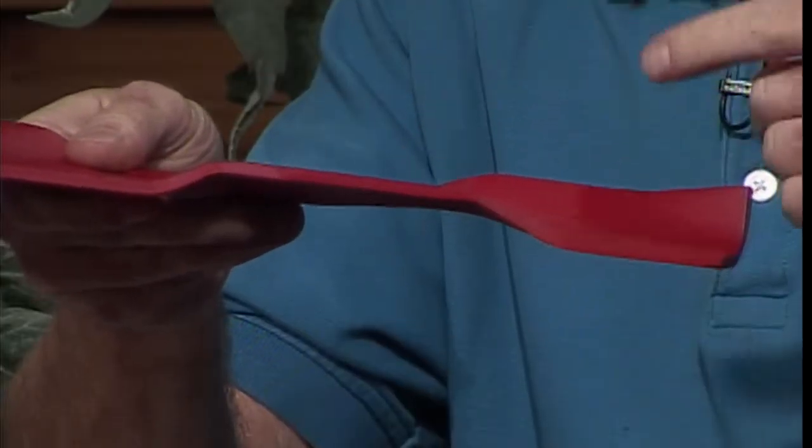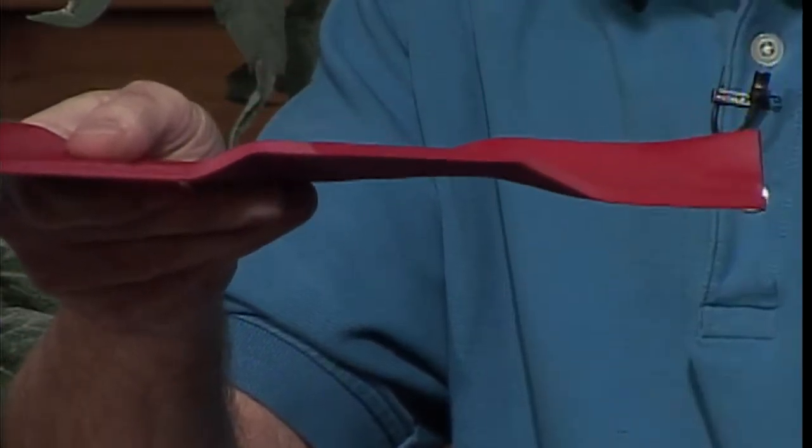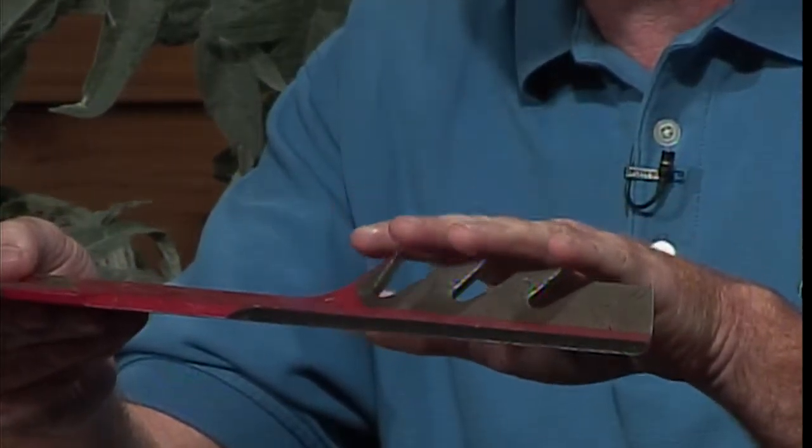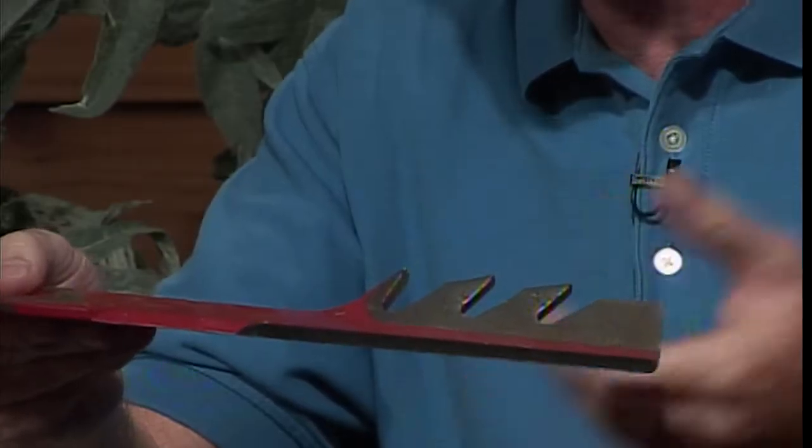So if you're wondering how we do that — on that mower you first saw, it had an enclosed deck with no side discharge, and it uses a wavy blade. This is the initial chopping edge. It lifts the leaves, chops them again, and keeps them in chambers, chopping and chopping until they drop out. On commercial mowers you can get blades like this. On smaller mowers they may have a different type of mulching blade specific to that model, but a mulching blade or kit will do the same thing. Now if you have a side discharge and no bagger, you may be interested in a blade with serrated fins that chop the leaf material.